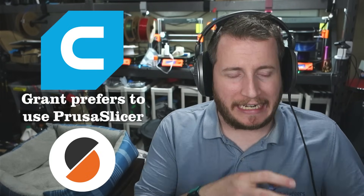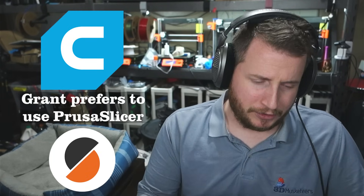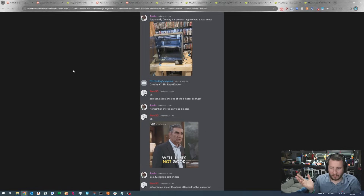I don't think it's wet filament — it's not experiencing any symptoms of being wet at all. Also verify that your cooling duct hasn't been pushed out of the way and isn't doing its job. We do have some special support settings that work well for us in Cura, but I'm not sure my settings will properly translate.